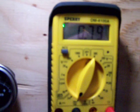I'll show you the open voltage of that panel. Just the amps shorted — 0.79, 0.80. Then I'll switch it over to give you a volt reading. Sorry about the shaky camera. The volts are actually 29 volts.